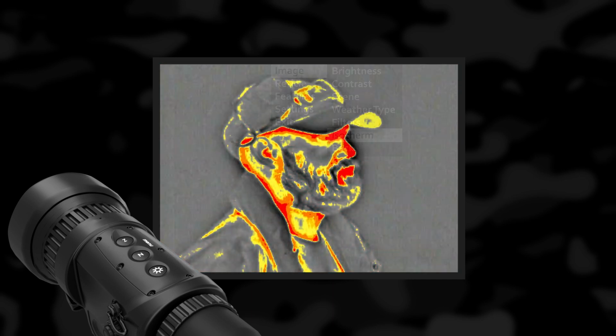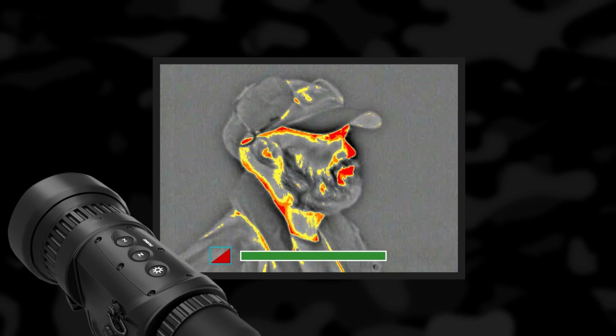Isotherm palette. The objects above the threshold temperature are colored in different shades of red. The temperature threshold can be set, increased or decreased by the temperature scale shown. Increasing the threshold value ignores the colorization of colder objects. This option is highly dependent on the distance to the object. It is highly recommended to try different values of the threshold in daily usage to find the right value for your personal preference.